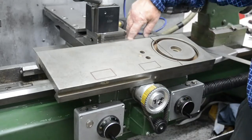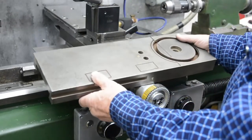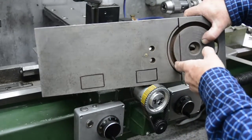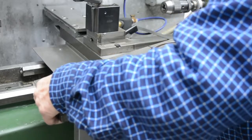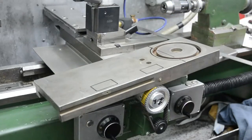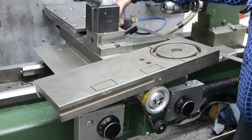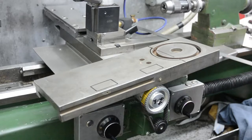If I cut it off to be the same length as the existing slide, I'd be cutting it off about here. So if I cut that off there, I've got the same length as I have, and this weaker spot is at the far end, and the tool post support can be bolted up on the solid end. This is a bit wider as well. I probably won't cut it off here, because a bit of extra length on the end is probably no hassle, and may be useful to bolt something back there at some stage in the future.